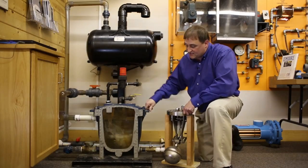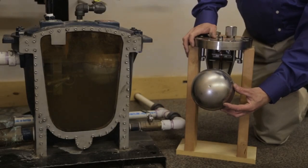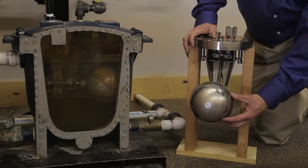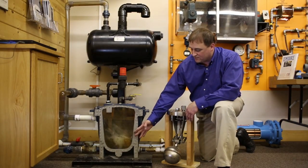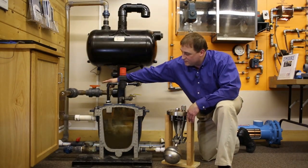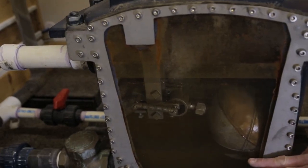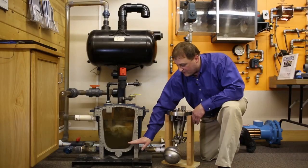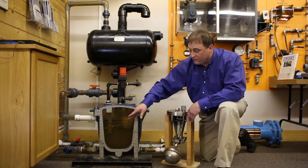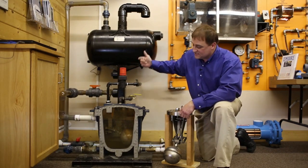I'm going to open up the water supply. You're going to see this pump flood rather quickly, get to the top assembly point where the float goes up, and you're going to hear a click. Now the float is going down as we're batch pushing the condensate out. It goes back to fill mode. Condensate is flowing through the inlet check valve and flooding our pressure vessel. We opened up an inlet motive air valve that's pressurizing this pot, overcoming the downstream pressure of the lift back to the tank. The inlet check valve goes to closed position and we batch force about four gallons down and out through the outlet check valve — four gallons of water forced out through the piping, back up and over, and back to a receiver tank in the boiler room. The system continues to cycle up and down.